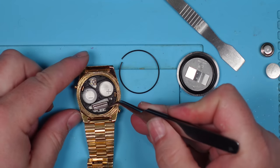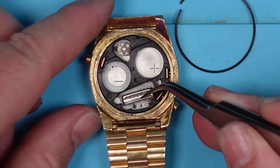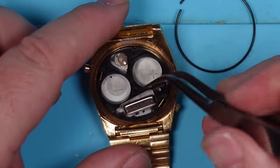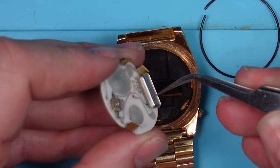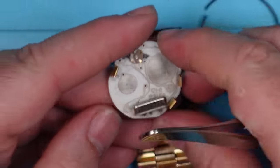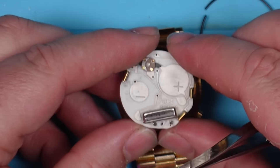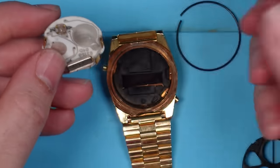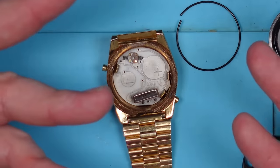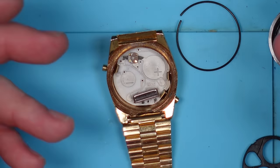Right, I think I know what it was. The crystal oscillator, whatever it is, was pushed right against the board and it was actually shorting out. Let's see if I can show you. So it was here and it was pushed against the board. It was shorting out with this track here, and these tracks are exposed. So they've got no silk screen on or anything. So it was presumably dragging it down or doing something it wasn't supposed to do. So I've raised that back up and let's see if it works now. I mean, it might not be that, but it was definitely connected to the chassis, so I'm guessing that is ground and I don't know.